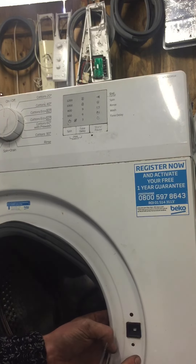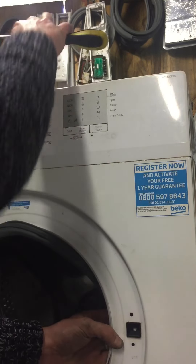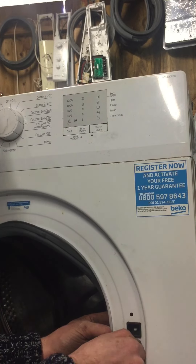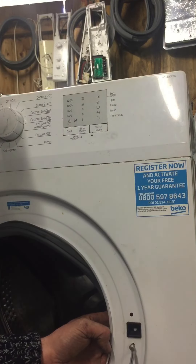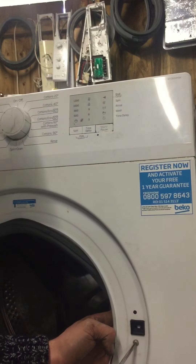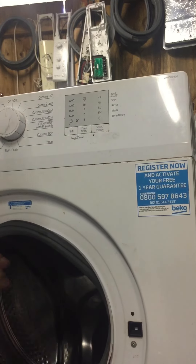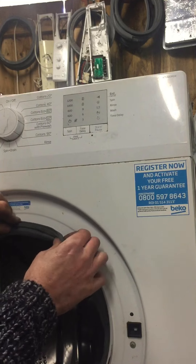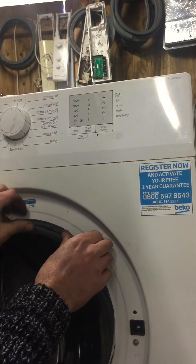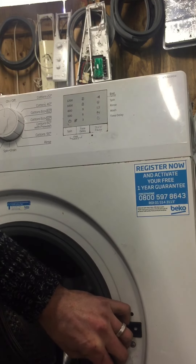Bring your lock back into the frame and line up the square bit here with the square bit on the frame. Put the left-hand side in first — you can see it sliding in — then push in the right-hand side. The top tab will click into place. Put in the bottom screw now and screw that into place. No harm to give it another check to make sure the plug is pushed in firmly into the lock before you put back your seal — which it is.